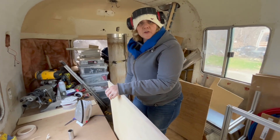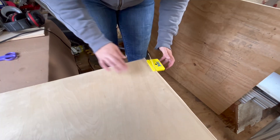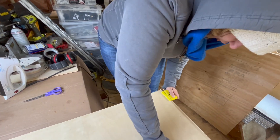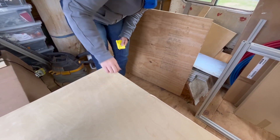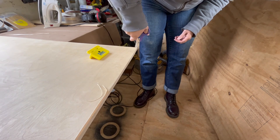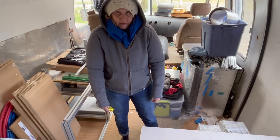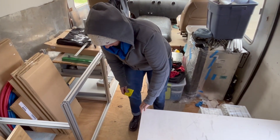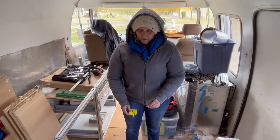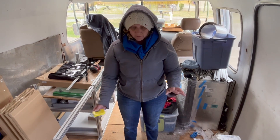Let's turn the iron off so I can turn the heat on because I'm freezing. Test one — I'm going to need wood filler because I scraped a little of the birch veneer off the plywood with too much pressure. You can see where I get it right and where I get it really wrong. I may have to take this piece off and do it again. I wasn't really sure how to adhere it and didn't adhere it in a straight uniform way, so when I was peeling it, it was kind of chipping out.